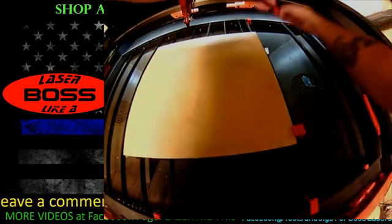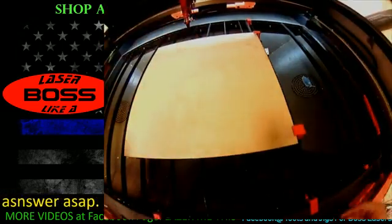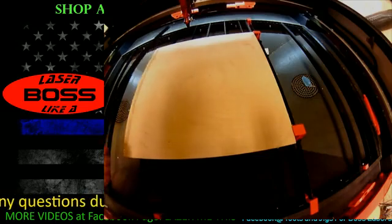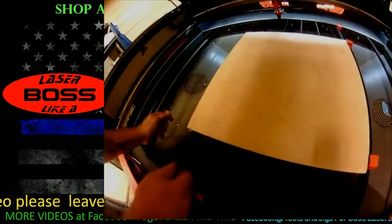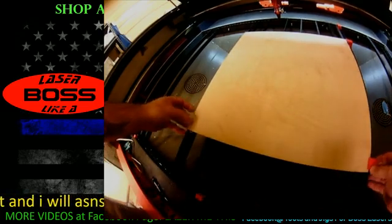You're going to go down at the other end. You could put as many as you want. The kit comes with six. Ideally three for each side, or two for each corner and two for each side here. So what you want to do is find a place to mount your material. Then you're going to come over to the other side, over here, and locate where you need to stick the blade on this side. So there's your support blade, and this blade, the profile, the point is on the right hand side. Set it right next to it. Now you have that all set.